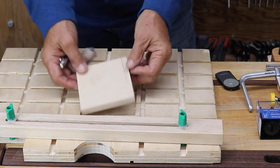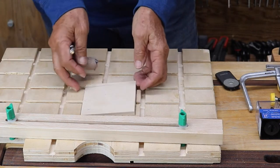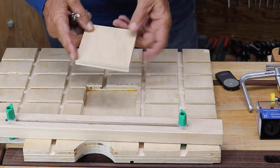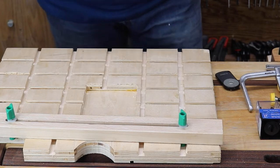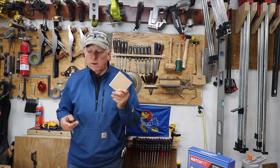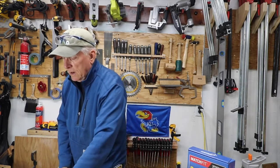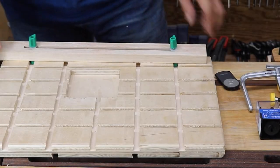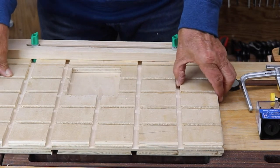This piece is replaceable — when you use it as a sacrificial piece and one corner is worn out, just pick it up, rotate it. When that corner gets worn out, rotate it again, and probably flip it over too, depending how far down you go when drilling. I also went ahead and made about ten of these spares, so that's pretty cool.